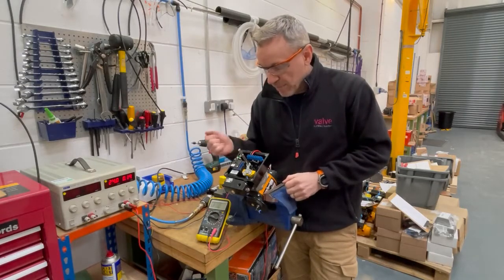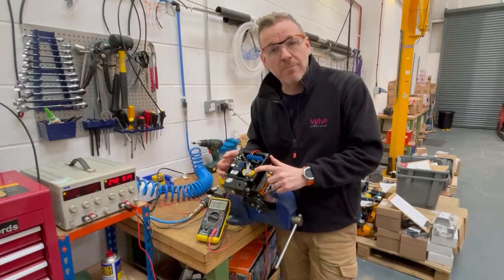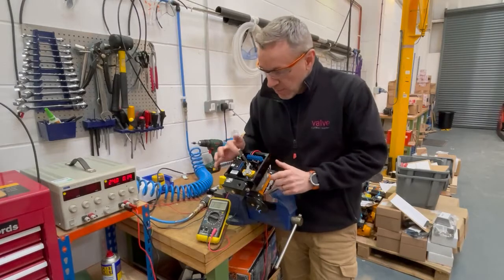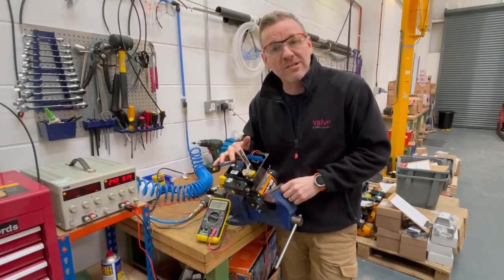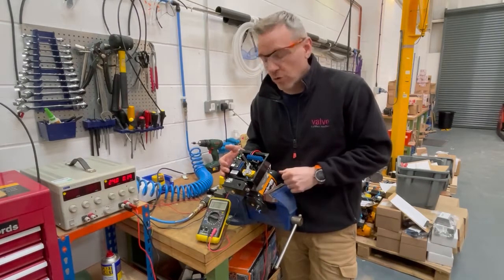The coil is pre-wired back into the terminal strip. In this version we've got the Westlock Magnum XT90 proximity switches with the touch-set cam, and we've got the magnet there which will actually cause the switch to make and unmake.